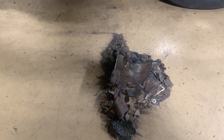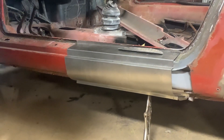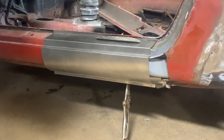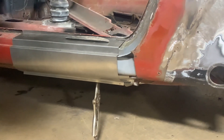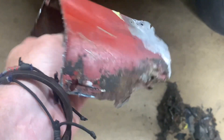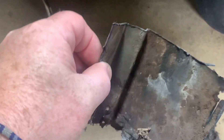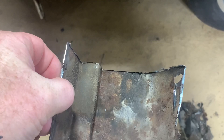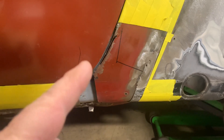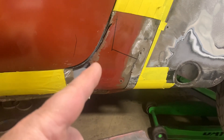All right, more parts made. Got all the parts made, now what we have to do is install them in order, but first we've got to prime the back of them with some weld-through primer. So now I've got the piece of rocker cut out — that's bad. Now we just need to probably trim a little bit more. So it's cut out on the black lines, and now this is the part that we need to go make. Let's take our pattern, find some metal, and get the part made.